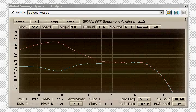The range the knob has is about 30 dB, which is very much, I think. But this change will happen to many frequencies, right down to 50 Hertz, as well as up to 500 Hertz. So you can only influence that range completely, but not in narrow ways.